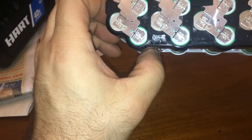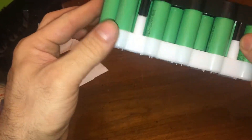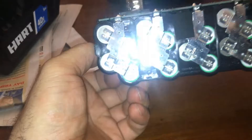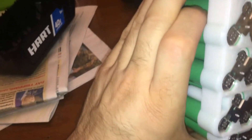What they have is two banks of 10 cells, so it's 37 volts with 2.5 amps each bank in parallel to make the 5 amps total. There's also a single wire here which is probably your thermal check — it's monitoring temperature.